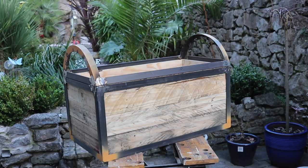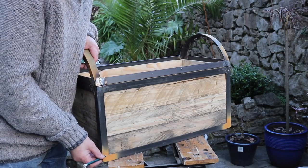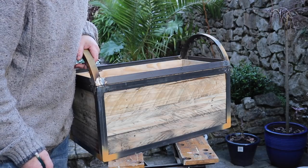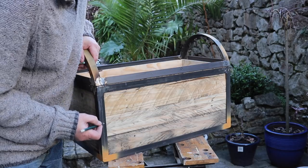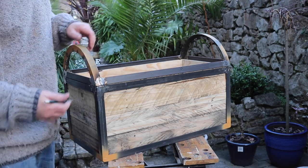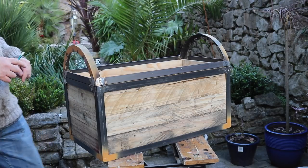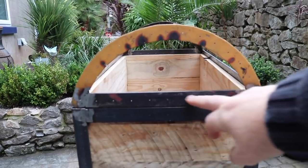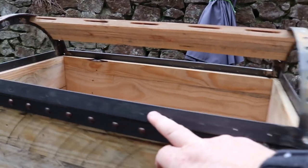I'm going to put a center line around all of the angle iron because I'm going to put pins in to make them look like rivets. You need to work out how many rivets you want on each side and space them out evenly on all the pieces of metal. So I've drilled holes to take the pins — you can see them on the right hand side and across here — and they look like rivets, pretty good.